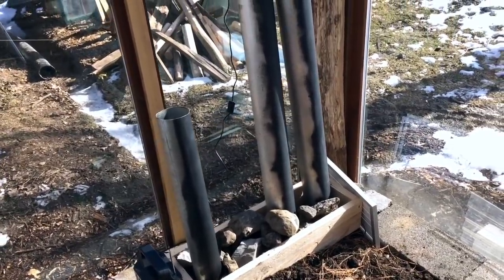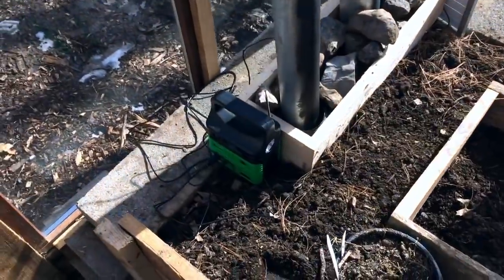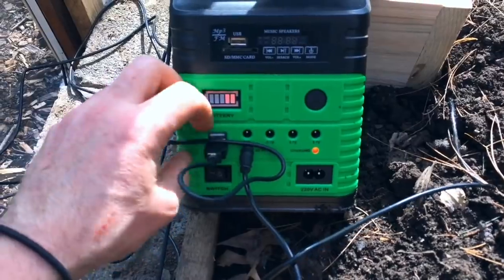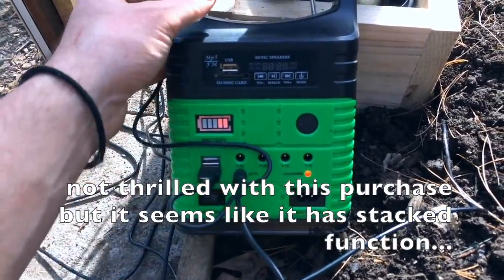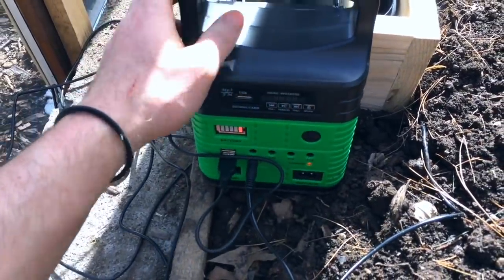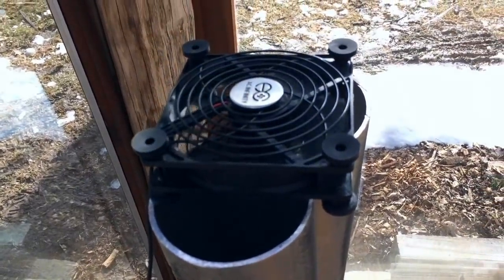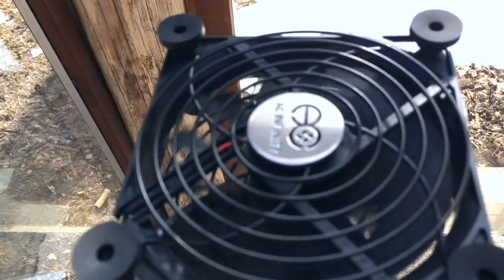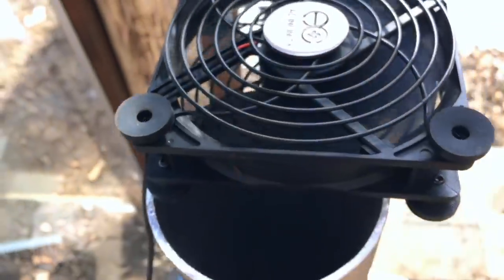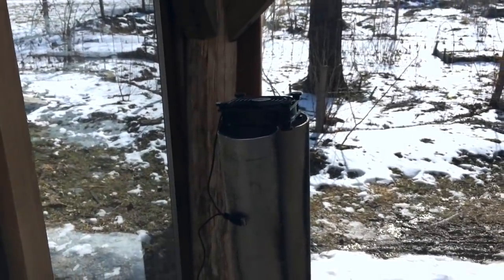It came very close to doing so. What I found is that with a little solar panel — that little doodad over there — and a pretty rinky-dink charger I got off eBay for around $50, it has a battery bank, plays the radio, and came with lights to illuminate the space at night. During the day it charges by sun and has a USB port where I plugged in an $11 fan — a 120mm fan right here. I'm really thrilled with the performance; it is completely silent even on high. With just that little additional boost of draw — this is aiming upward — I now see air coming all the way through these pipes.